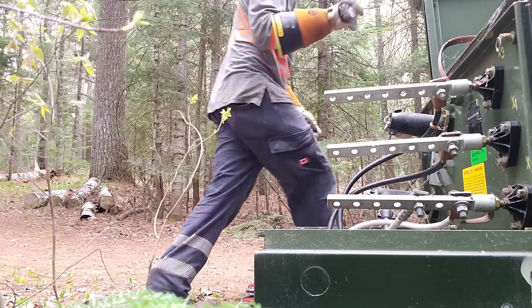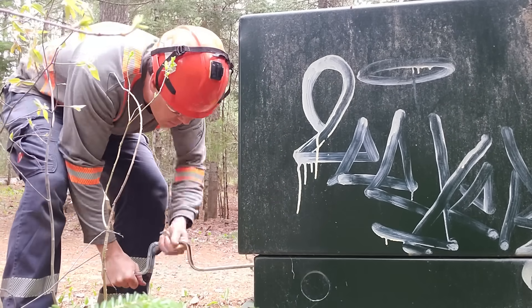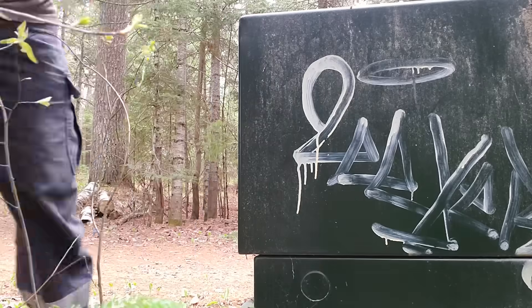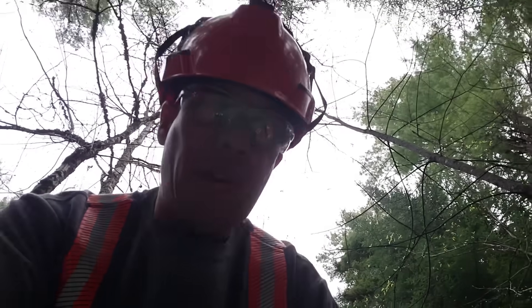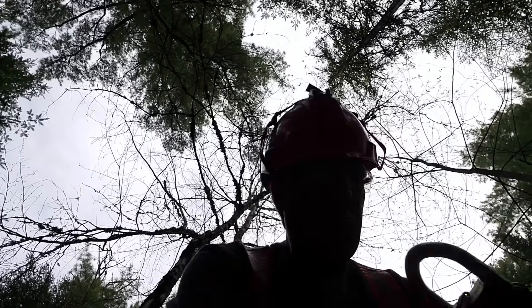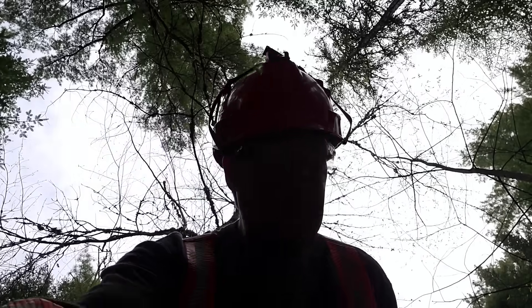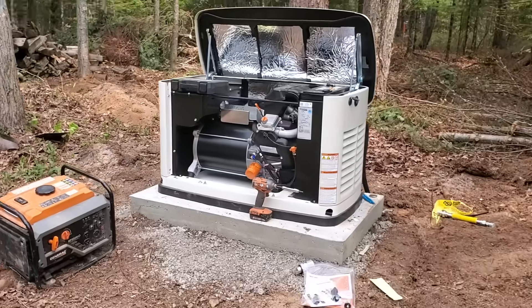Alright, so we're all set. Let's lock this guy up. The last step before we give the electricians the okay to go to work is to check the voltage in the meter socket, which I completely anticipate being zero — however, we are going to make absolutely sure. And then, once their work is complete, we'll do a quick inspection and put those leads back on pretty much the same way they came off. Alright guys, that wraps up another one. We have the customer all hooked back up. Thanks for stopping in as always, and we'll see you all soon.